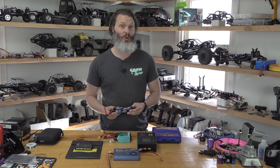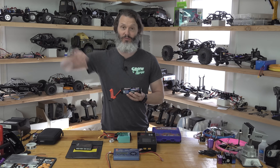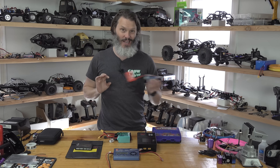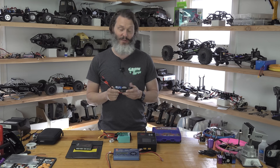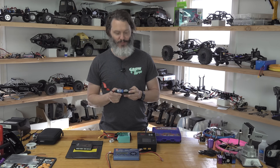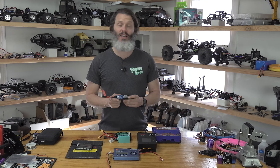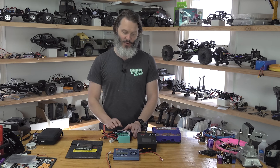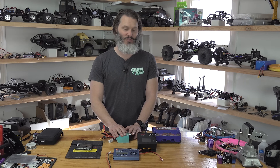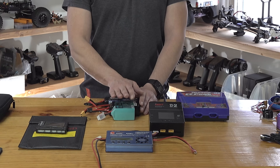When these go up, not only can they shoot flames way out because of the solvent, they can become little rockets. If it gets into a bad enough thermal runaway situation, you can have a flame that literally is not extinguishable until everything is out. This is why house fires from batteries are unexpected and usually not attended to very well. You always want to attend to your charging.